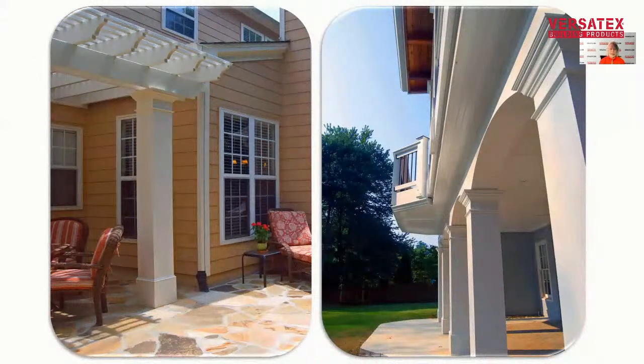We did a lot of wraps where we didn't really have a ceiling to hit up to with the bed and crown. So what we did is we just took a piece of 5/4, took a Roman ogee routed edge, and made little caps on it and installed them a little differently in different applications. But you can see how we were using them and when we were using them.